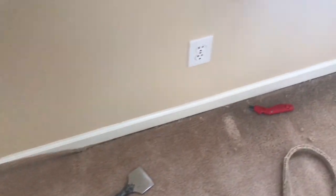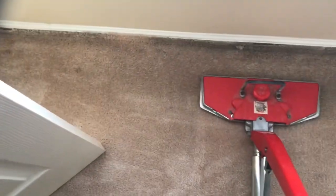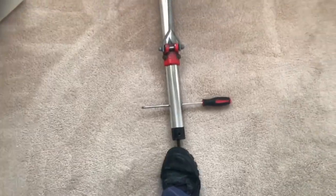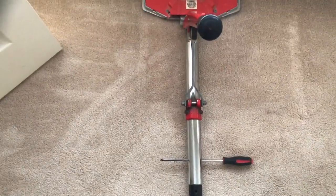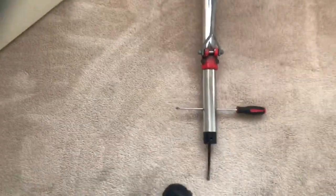I've already pulled the carpet up, as you can see here from the baseboards. We're going to pull some of this carpet in this direction, and then I may have to pull some towards the closet as well. I've got my tubes already spread out and ready to go. I've already stretched this side here. That's my power stretcher — that's the head to it — and I've got my single tail rat tail right there, since we have a subfloor here.